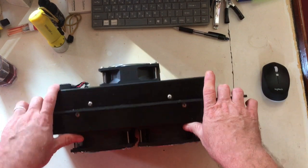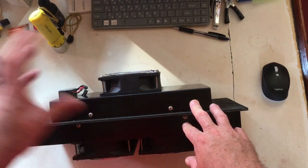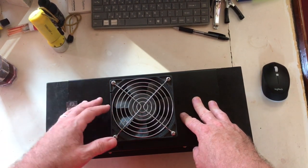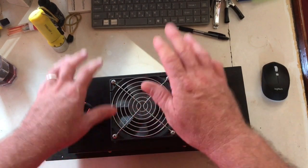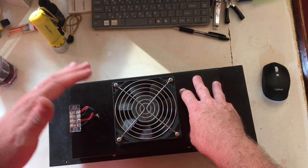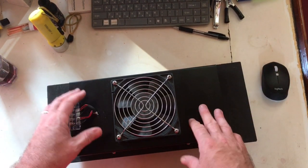I hope this little video answers some of the questions. When I turn it on, it'll peak at about 8 amps — because I make everything at 24 volt DC, so everything I have runs on 24 volt DC. With this at 24 volt DC it goes up to 6 to 8 amps, fluctuating depending on the outside ambient temperature. As the Peltier units start doing their job and get balanced, the fans are removing the heat as fast as they can. The hot and cool side balance out — I can actually get it down to about 3.5 to 4 amps per hour. When I've got a day of full sunshine and it's humid out, I'm on the water, on the ocean, literally at sea level.